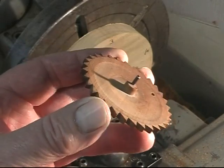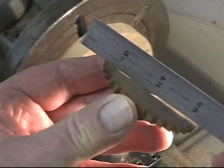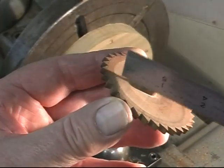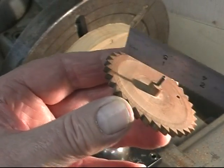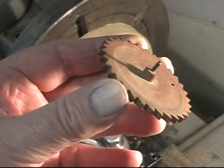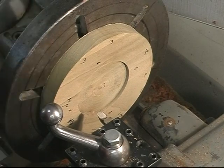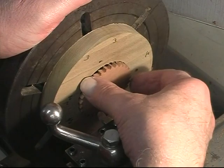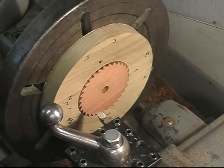Now this original gear, as you can see, there is a gap under the roller, which means this is recessed here, and it's about a 12 thousandths recess from 7/32 from the tip of the tooth, right through the center. To put the undercut in this gear, I'm going to use the same faceplate, and it's held on with four clamps again.